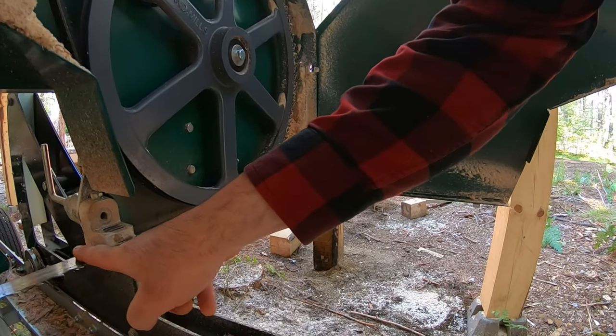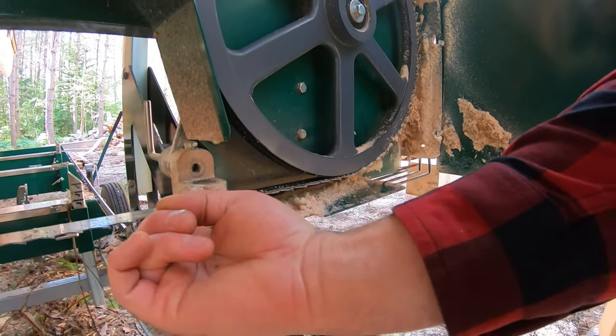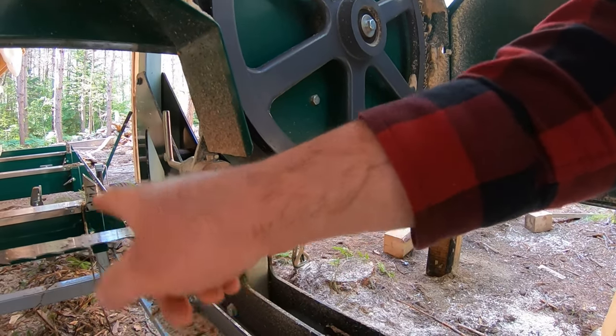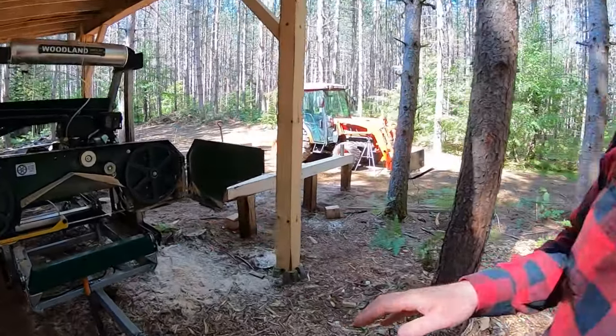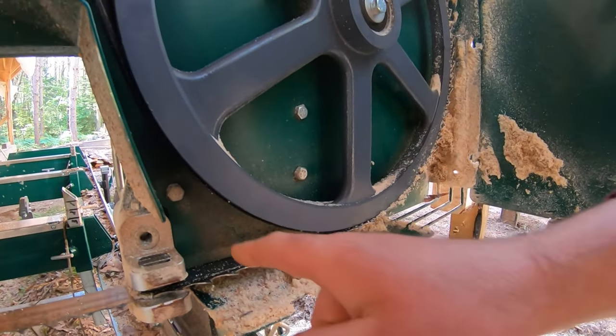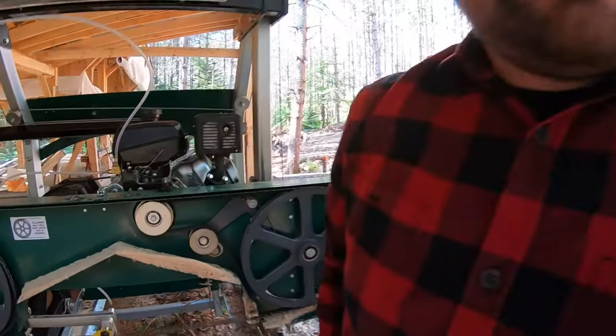Unless you have a feeler gauge, you're probably going to use a thick piece of paper. You can slide that in on top of the blade — it goes in between that top block and the blade, and likewise between the bottom part of the blade and the top of the bottom block. That gives it just a little bit of space so that when the blade is turning it's not touching the guide blocks. A lot of people are under the impression the blade should be rubbing on those guide blocks — no. The blade rests on the belts on the band wheels, not on the guide blocks.